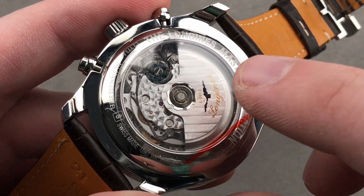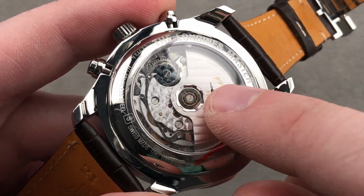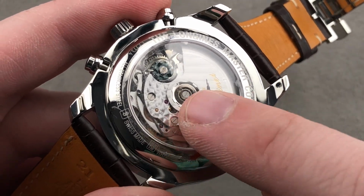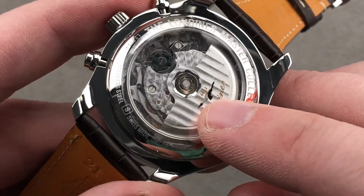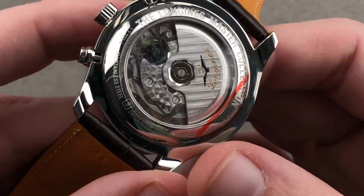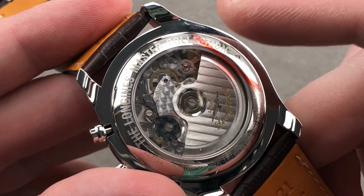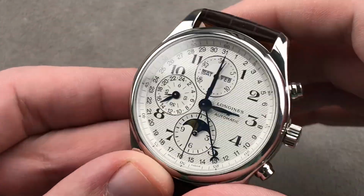Unidirectional winding, the watch has a 54-hour power reserve, and it also includes another refinement, which is the power reserve itself. A standard 7750 would be between 42 and 46 hours, so getting 54 here, just over 2 days. It's a refinement you don't expect in this price point. Now, all the finishing here is mechanical, but the movement is good looking and of high grade. The watch beats away at 28,800 vibrations per hour. A great looking movement, pivots on 27 jewels, and of course you're getting a lot of sophistication for not a lot of money here.